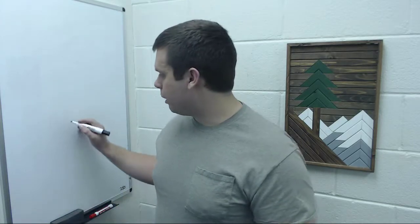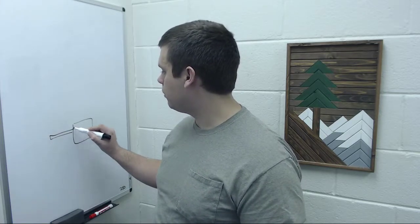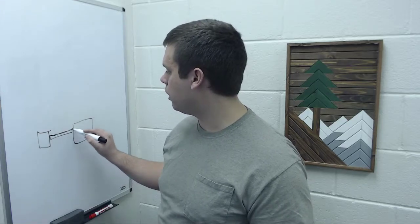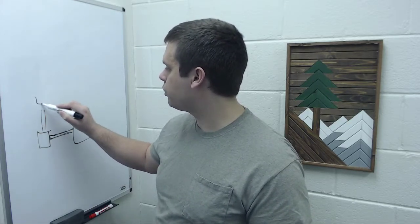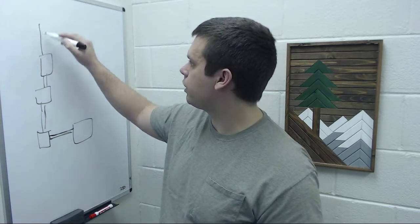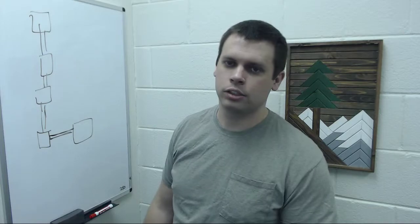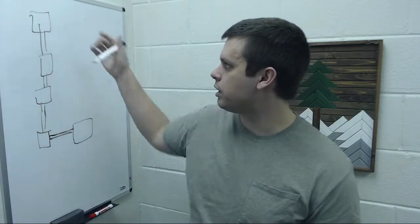You can use serial. Yeah, I did try serial. So serial communication, what do they call it, UART. You would think that would be perfect. But you have your main computer, you've got your 2 lines that go over to your first Arduino, and then 2 lines go over to your next Arduino, and then the Arduino after that, and you're going to just daisy chain the serial lines all the way from this end to that end.